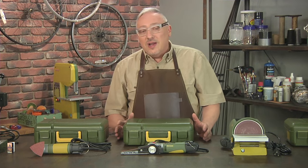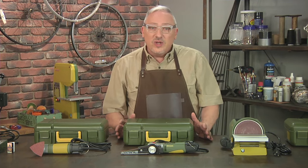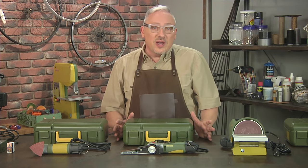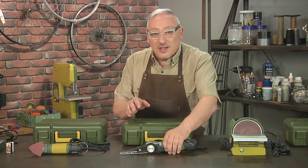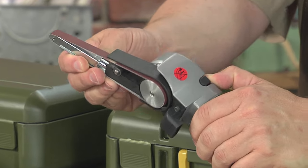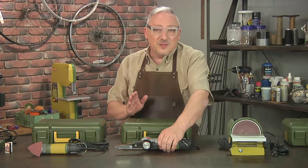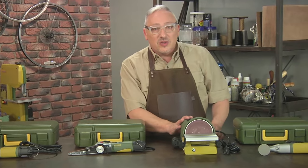It can be used for grinding and enlarging small openings, grinding in notches, regrinding molds, or polishing flat surfaces. It's also great for deburring, rounding edges, or removing paint. Want a different angle? The belt arm itself is adjustable within a 60-degree angle by pushing this button on the head. If benchtop sanding is more appropriate for your project, the disc sander comes into the picture.